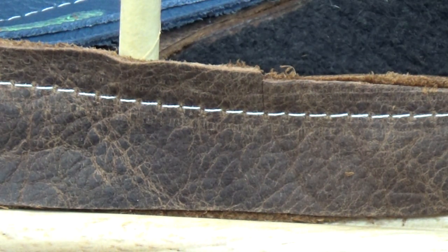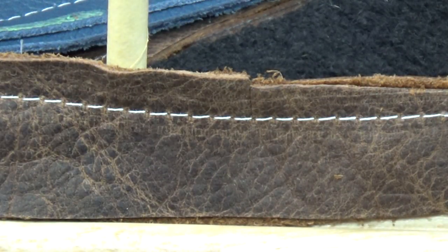So totality of the stitching, I got to get that turned just a little bit. Totality of the stitching gives you a real good impression of just how beautifully that machine is working. But if you get really close to that stitch and you compare it in your mind to the stitching on the other side, you're going to see while it's a beautiful looking stitch, it's a little bit compressed. I've talked about this numerous times in premieres. And compression happens when the tension either on top or the bottom, in this case the top tension, is turned up a little bit higher than it needs to be. And what it's doing then is it's pulling up too hard and it's actually compressing the length of that stitch just slightly.